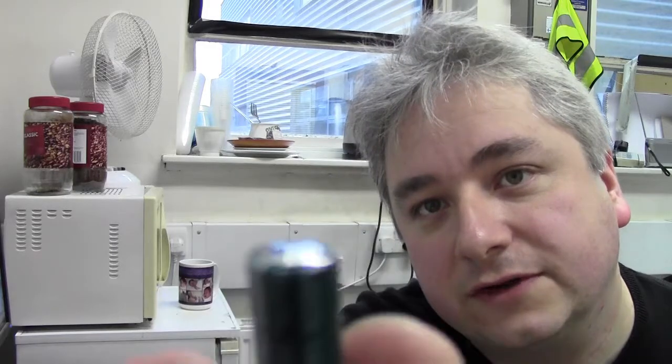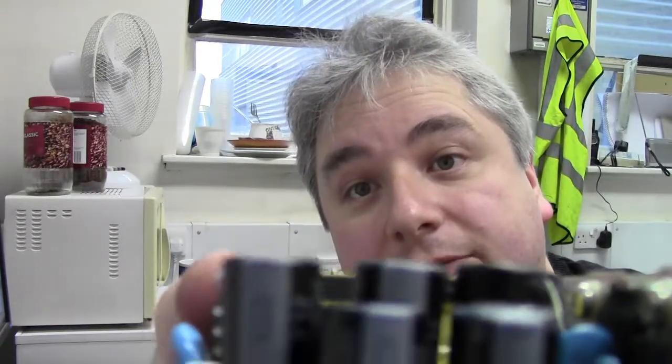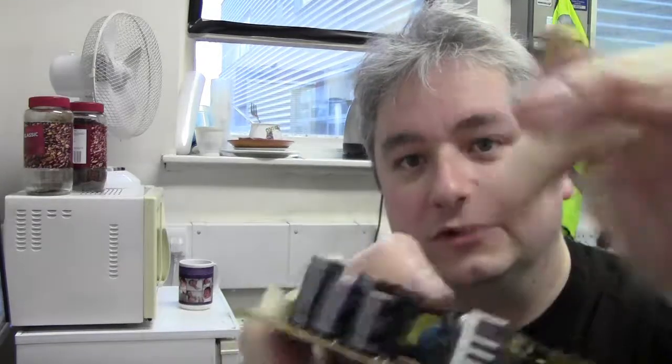Right, and welcome back. My capacitors have finally turned up a day later, and I have replaced these capacitors. If you take a look at this capacitor, you might be able to see the top is bulbous. Here's another one that looks a little dodgy. It's fairly bulbous compared to these ones, nice and flat, not a single bump. So I replaced all five of these around this area.